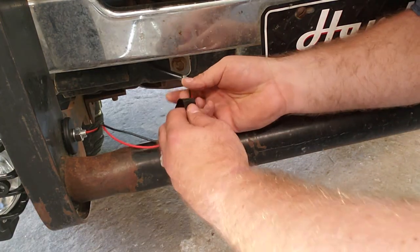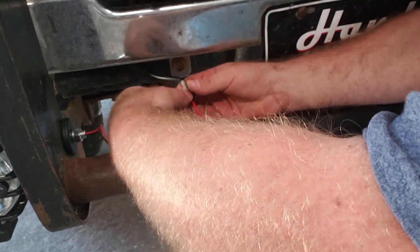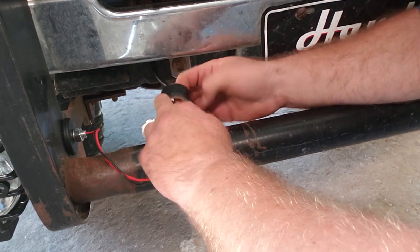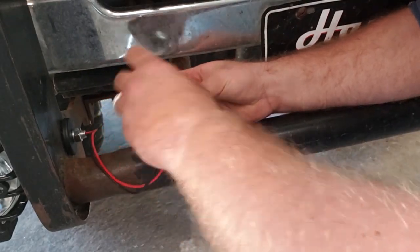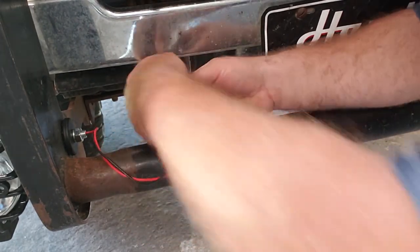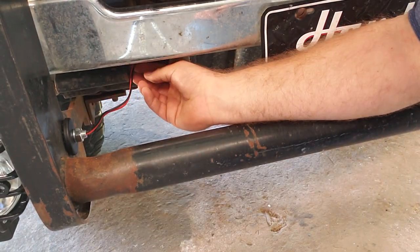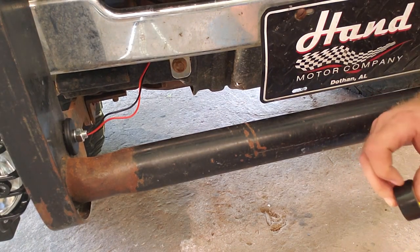Now that we've got the wires connected, I'm going to go ahead — and this is probably just a layer of security you don't necessarily need, but it's going to make me feel a little bit better — I'm going to put electrical tape all the way around these wiring connections. If nothing else it will help keep moisture out, and moisture and electricity are really good friends but they're not good for you. So we want a nice secure connection that'll keep all that moisture out. I'll feed those wires right back up through there and come through and zip-tie them in so they're secure and we don't have to worry about them getting chafed or cut on anything as we use them.